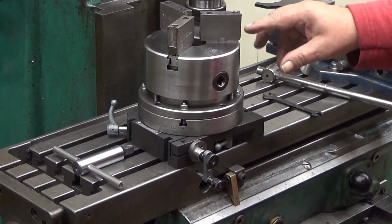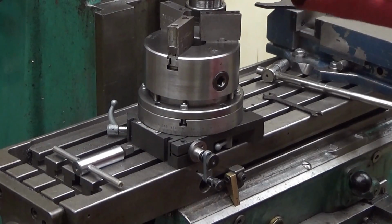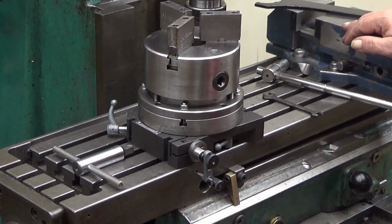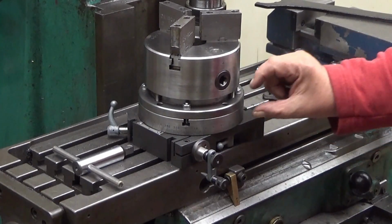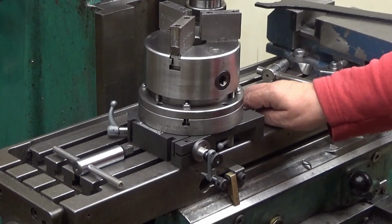So, and as you can see, it's pretty high. So this is really, it all adds up. And now I probably have only about this much here on the top for my workpiece. So, well, there are a few solutions for this. First of all, there exist 4-jaw chucks which are really low profile. So that's one solution, and they are suitably sized for this milling table.